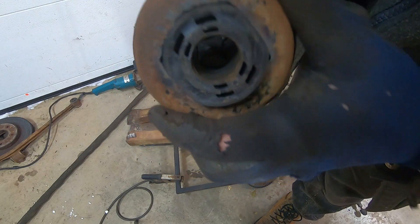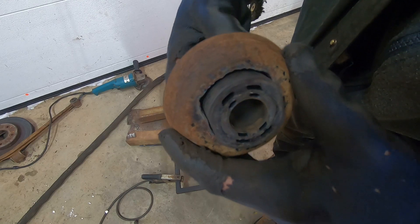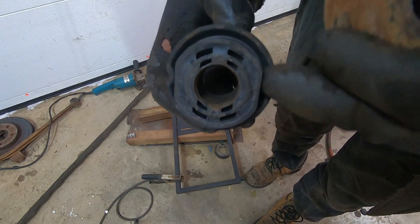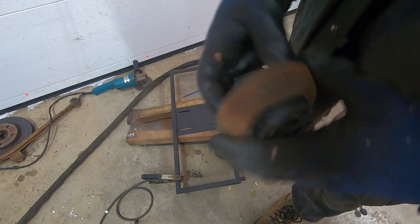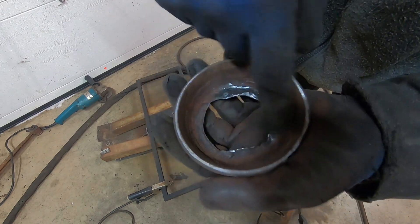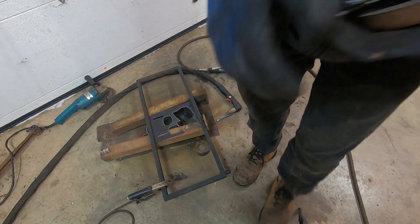This now fits in there quite snugly, not too much clearance, and it won't rotate — and that's the thing, you don't want this bushing to be able to spin. It's not a circle; it's got flat edges, so I think that's going to work out beautifully. You also want to grind off all the burrs from your cutting and make sure you have good contact so your bushing doesn't prematurely wear against corrosion and stuff like that.